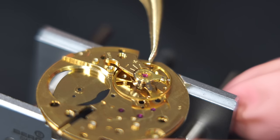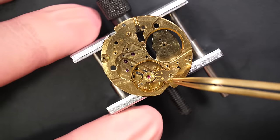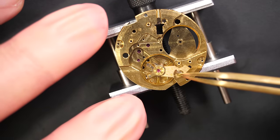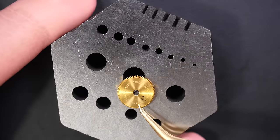Placing the balance back just to keep it safe during cleaning — that's the best place for it. Just make sure it's fully in place there, now it's in position and I can secure it with the screw. You have to make sure the balance is fully in place or else when you screw it down you will crunch the staff.